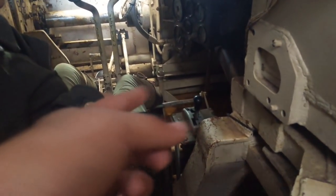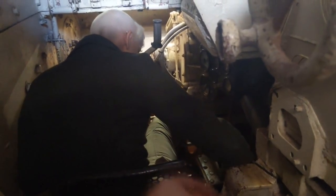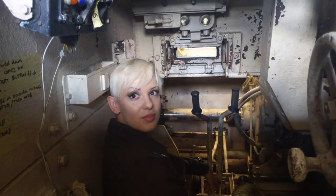That's right. You're going to pull that little tab out that's sticking out the side, and then you'll pull it back into reverse. You think that's enough, but underneath that drive shaft there's a little cable linkage that you see on the other side. Pull that cable towards the front, and then it goes into reverse and it's happy. After that, you don't have to touch it ever again. All you have to do is worry about using the actual little shifter, and it's fine. Other than that, it's pretty straightforward.